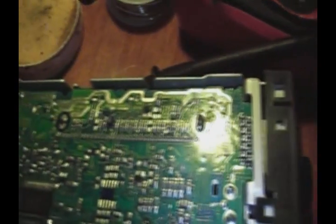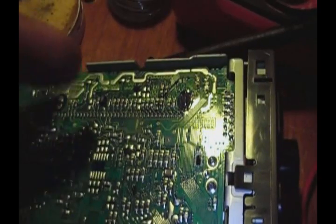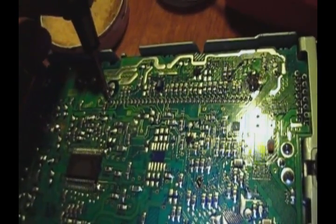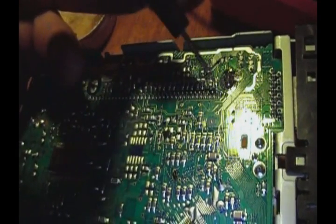At this point, if you remember, this column of pins will be on the radio where the antenna comes in from the back. On this one it's here, and it goes to a little metal box that tunes into a particular channel. It's going to send a preamp right and left out, and a ground. On this one I found numerous ground pins with a continuity meter — just touching the pin and the other end of the meter to known ground. I think it was pin one and pin eight, and then the one on this end and number three from this end.